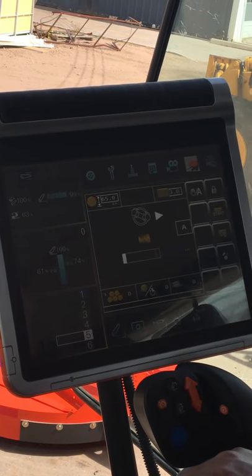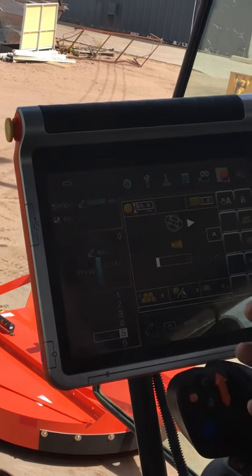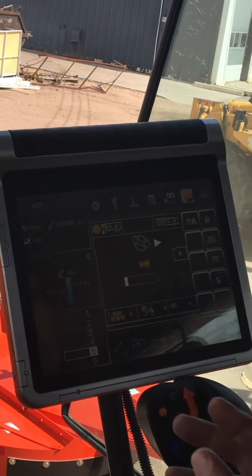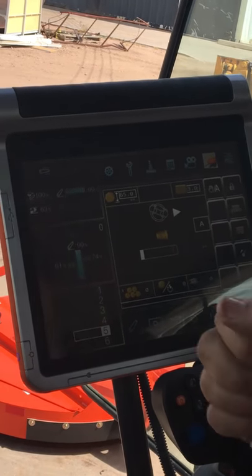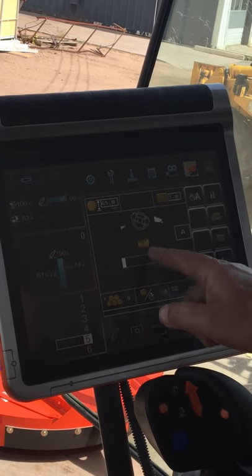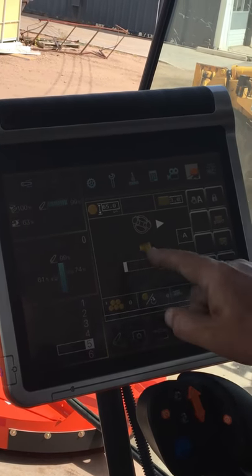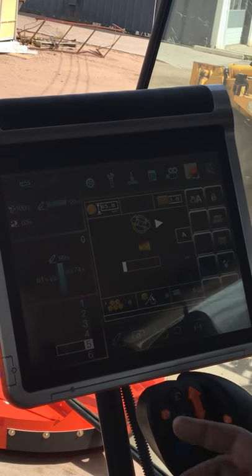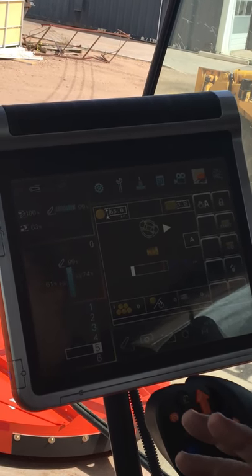You can see this little steering wheel on screen as you go through the field making your bale — it's going to give you three visuals on how you need to drive to make a great-looking bale every time. The steering wheel will turn right or left, you'll get driving indicator arrows that get stronger as you go out, and you'll also see a bale icon showing the bale shape — cone-shaped one way, hourglass-shaped another — telling you exactly what your bale looks like.